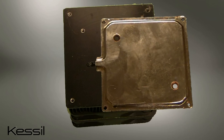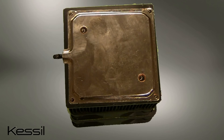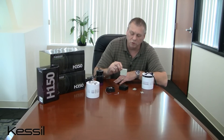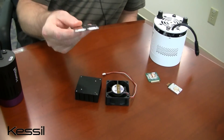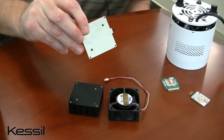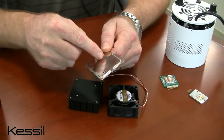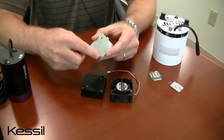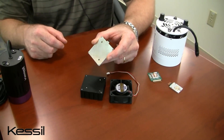But the real key is the use of this vapor cooling element. What this does is provide cooling through the use of a vapor phase exchange, in which a liquid inside the vapor cooler is vaporized — turned to gas at the center of the cooler where it is underneath the heat being generated by the LED array. That vapor then moves to the outer edges of the vapor cooler and to the bottom side, where it condenses back into liquid, releasing the heat.